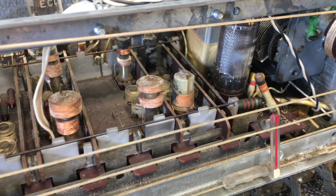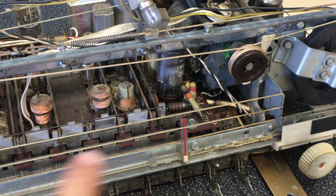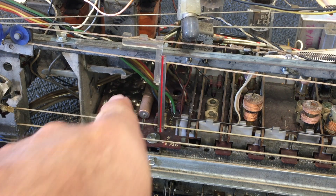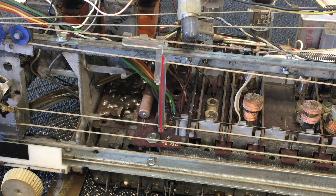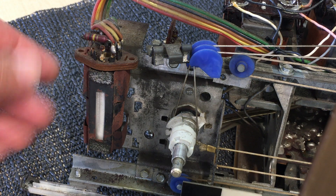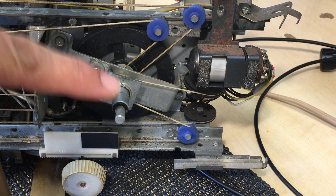The reason for that is some of the parts of this radio are incredibly difficult to get to. With this side off you can actually get to a lot of the components that otherwise would be unreachable. This thing has three PC boards — four actually — but there's a main one here with some of the switching, and others underneath. To get to these components to test them, you really have to have access from the front. It also keeps the faceplate safe. The actual potentiometers so that you can oil them, and of course the tuning here as well, that you need oil.